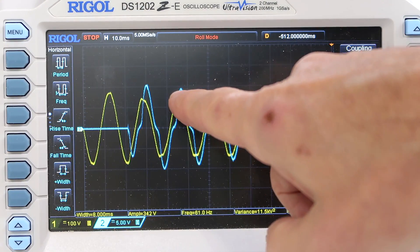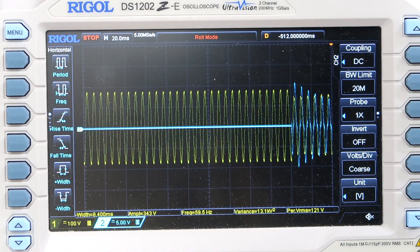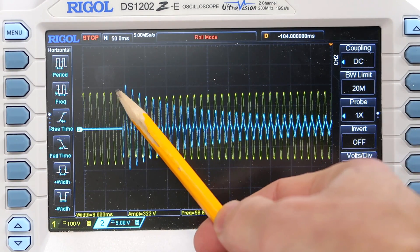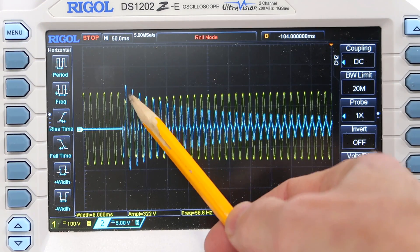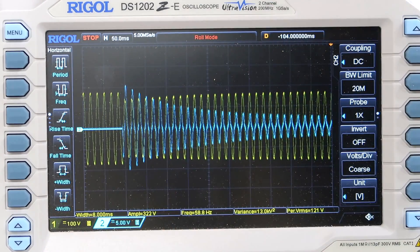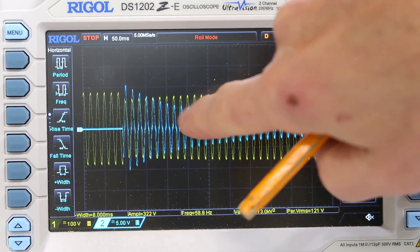But just after two 60 hertz cycles, we can already see that drop off significantly, and zooming out more, within half a second that starts to get pretty reasonable. You'll also notice that the line voltage coming in — that's the yellow trace — drops quite a bit when the saw starts, because that circuit is way overloaded. But breakers will pop over 100 amperes, or at their rated current, if it's on for several minutes. So this was not enough to pop the breaker.